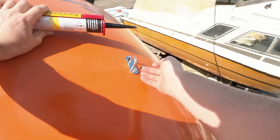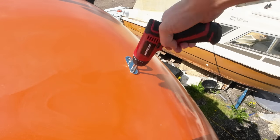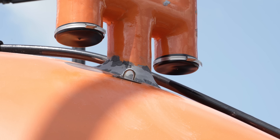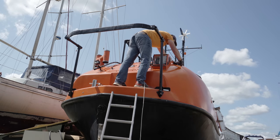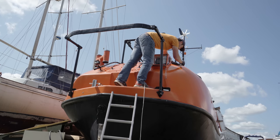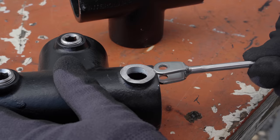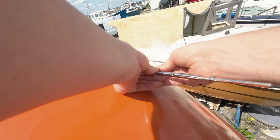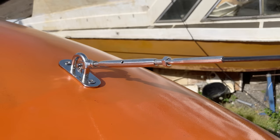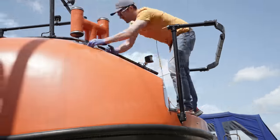That's one done, and it was important to position these carefully so the wire ropes can reach. I set the turnbuckle tensioner to halfway along its length so I didn't end up with too long or too short. I did the starboard side one too — even I'm not obtuse enough to forgo this symmetry. I double checked the lengths, and then it was time for the finishing touches. The jaws of the wire ropes won't fit around the thick steel of the tube clamps, so once again a moment for grinder mk2 to shine. I flattened the protrusion, checked it now fitted, and then did the paint thing one last time. I connected the wire ropes, tensioned them, surveyed my work, found that the whole structure was pretty damn strong, and confirmed that it matched Alan's industrial aesthetic and not some dainty curvaceous yacht railings.